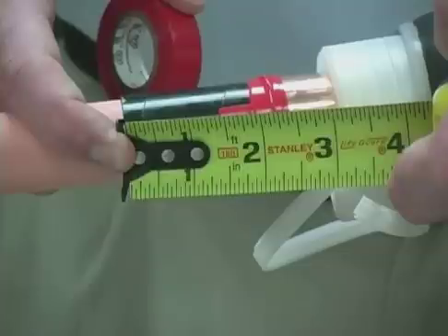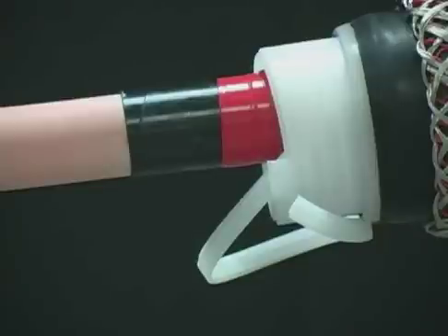Install several turns of marking tape onto the cable Semi-Con, one and a half inches from the Semi-Con cutback as shown. This will be a guide for installing the splice body. The tape should be installed on the same side where the splice body is parked.